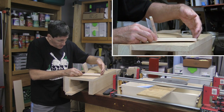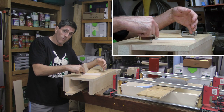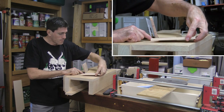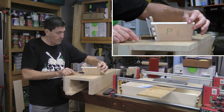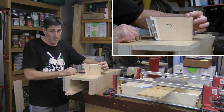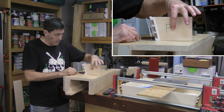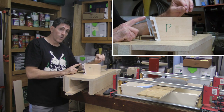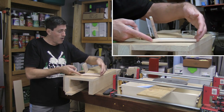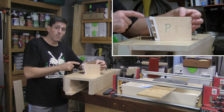So ultimately, mathematically, if we were to lay this thing down flat, it would be a straight cross cut right across this board, because it would be located at the same place as the bottom. From there, it goes to a cross cut, and as you go further up, further up, further up, the miter angle becomes more and more pronounced until at least this stage. Of course, if we went all the way up to 90 degrees — I'm just letting it stand here in front — then it's going to match this bevel gauge angle. So we go from a 90-degree cross cut when the board is laying down all the way up to the angle on this bevel gauge — the miter angle will be in between those two.